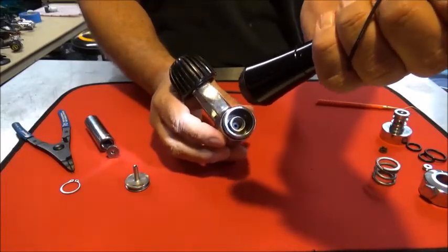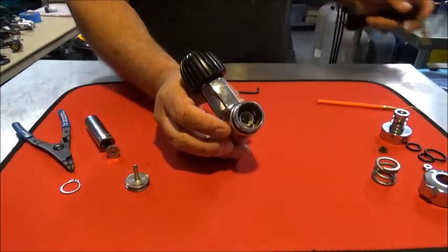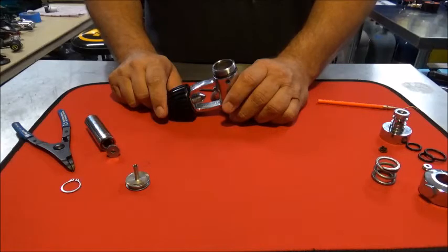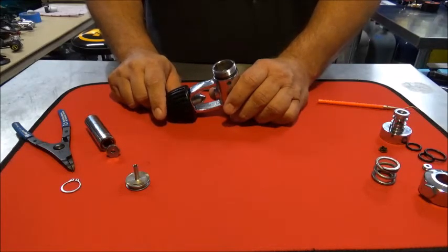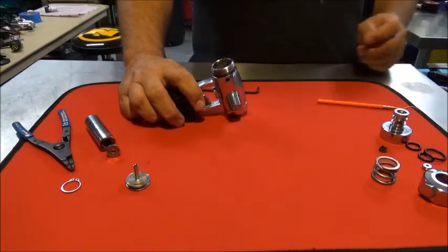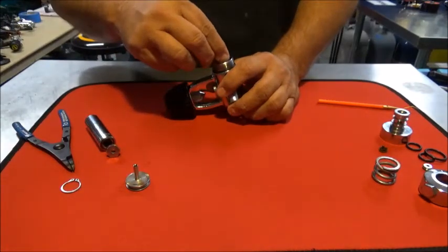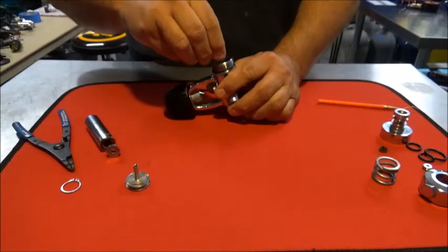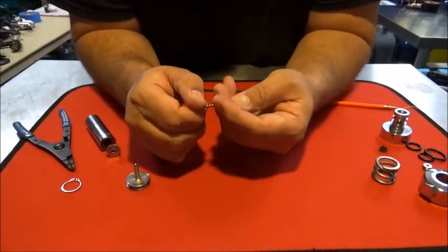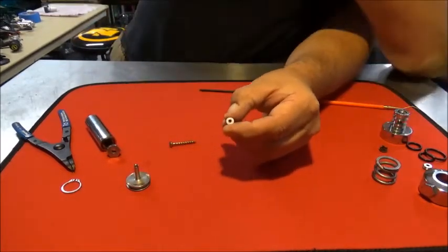I'm trying to zoom in on the high-pressure seat so you can see it a little better. Now, there was a tool used to remove that high-pressure seat - I don't have the tool, I've never seen the tool. The high-pressure seat has an O-ring that holds it in place by friction, and it is surrounded by the nylon high-pressure seat, and in the center is a brass cone. The easiest way I've found to remove it is to get a suitable size brass screw, turn it in there just barely enough where it grabs, and then pull the seat out.